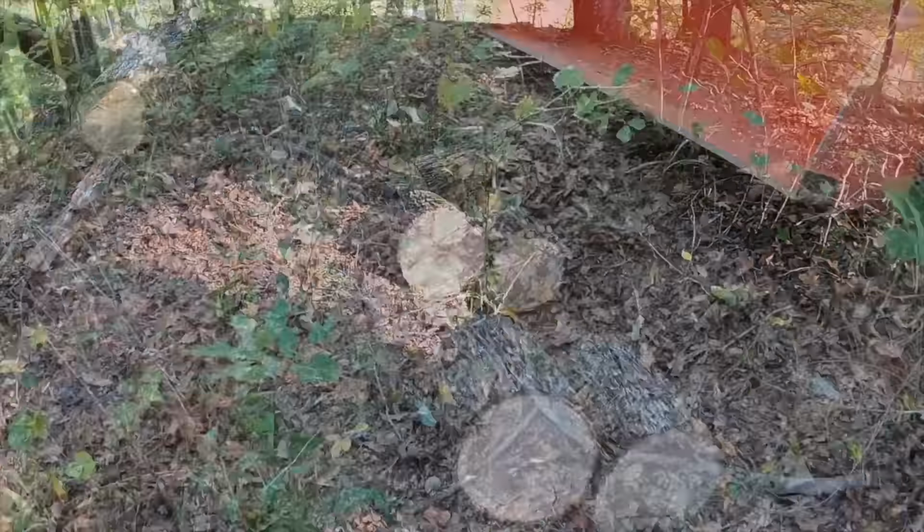All right, I've been scrubbing on this chimney for about an hour now. Let's see how it looks. All right, I wish you could see it better, but right here close to the camera, you can see there's obviously still some creosote going on, except you can see the terracotta in the patches there. But down on the bottom, the very first two liners are extremely clear. The third one right there is where the little globs start. This fourth one has a little bit on it, and this last one is pretty much clear.